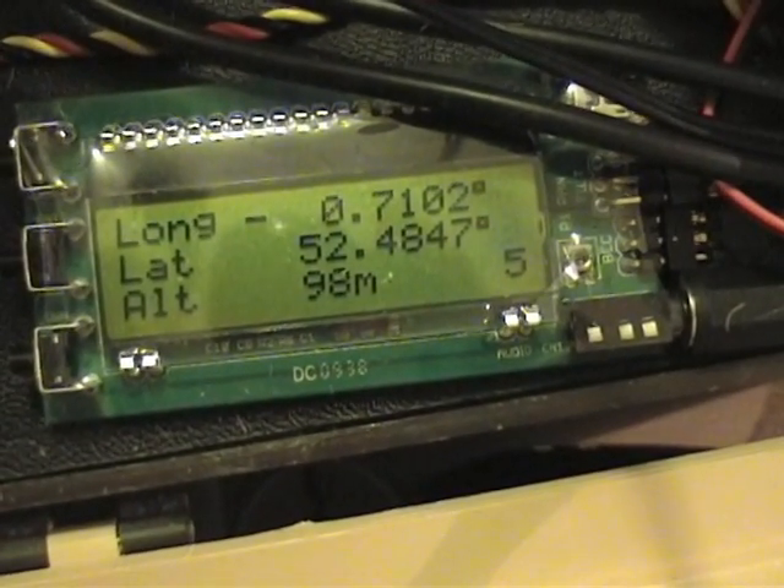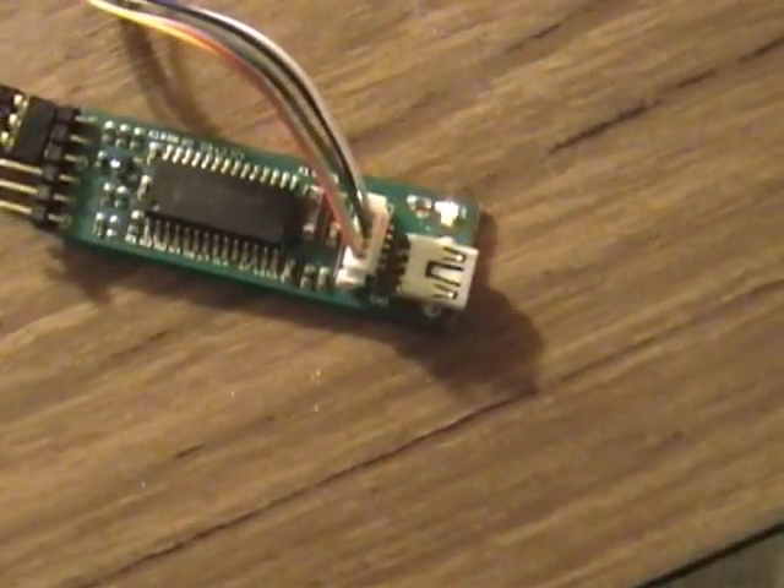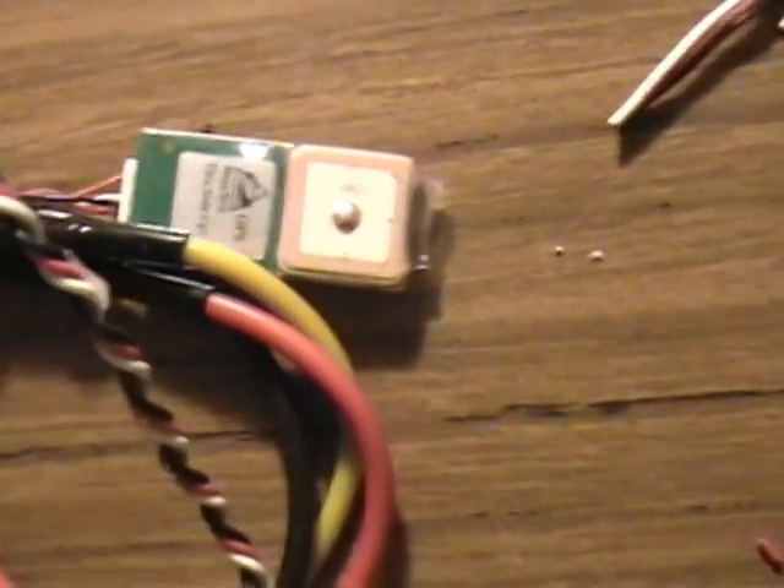We've got our five satellites — the tracking antenna is working. Obviously it will be facing in a strange direction because it doesn't really know the home position. With everything so close to each other the tracking antenna was unable to function very well — it is really sensitive. There's the antenna. I'm hoping our little GPS unit here for the FY21 has also found some satellites. That's 10Hz — oh, that's 10Hz as well. I was about to say this one is 5Hz but it's not — I've changed all that around.